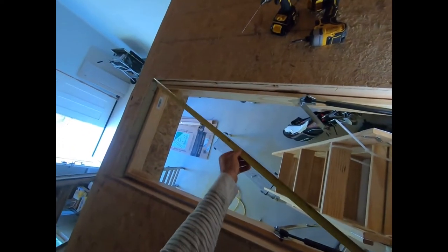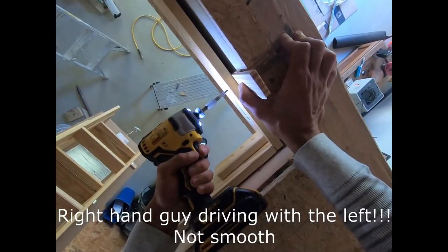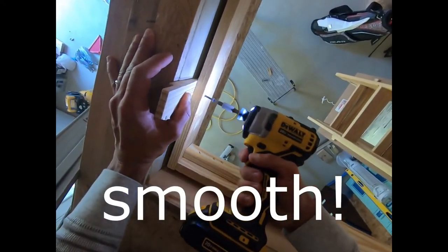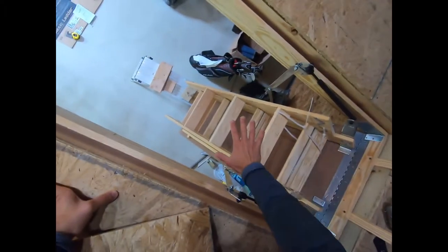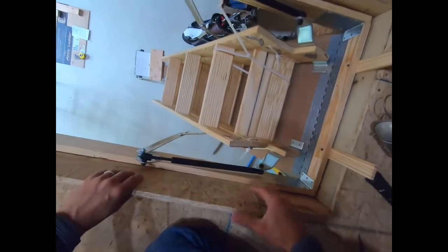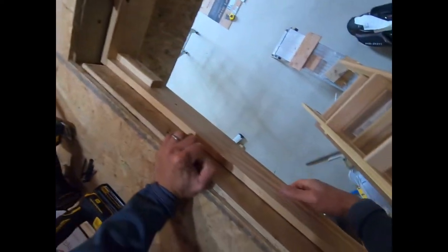Slowly opened up this door. Now I'm going to go back up. I've got to secure this end of the frame into the header. You want to measure diagonal to make sure that you are square. I got my headers screwed in. My support is still intact, so I'm able to push the door down and we're going to do the sides. I cut a half-inch piece of ply — I'm going to see if I can jam it in there. Be mindful where the pre-drilled holes are, because you want to make sure there's shimming behind those too.